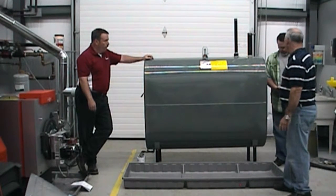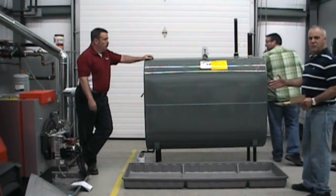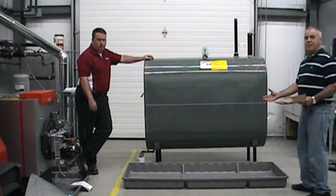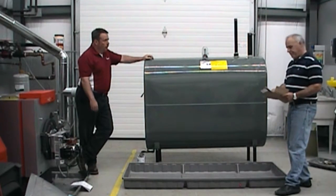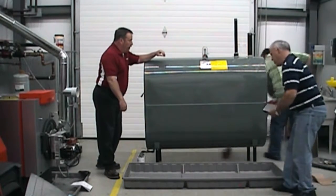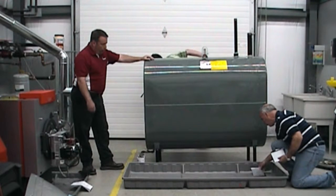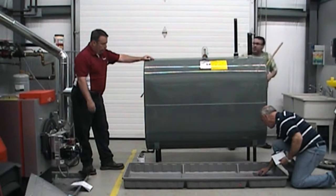We need to make sure your tank area is nice and clean. The tank should be moved away from your final installation point when you install the tank into the tray. You can finish doing all your fittings while the tank's in the tray, and then after that you slide the whole tray with the tank back into position. You want a clean area so there's no debris poking through that tray — no rocks or anything underneath it. One little sheet metal screw will do it in.